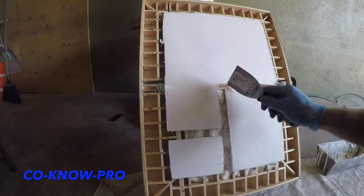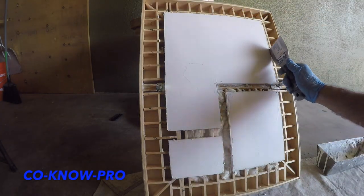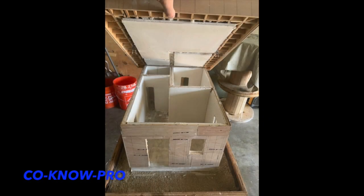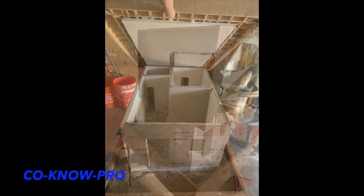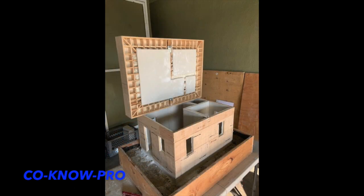I want to mention that the typical process on building a structure, before you do insulation and drywall, would be to seal off your roof first, then install your exterior lath — all your exterior paper and house wrap to waterproof the house. Then before you install your scratch or stucco, you install your insulation and drywall on the interior. Once that's done you go ahead and scratch and stucco the exterior. We've switched the process around a little bit, but as long as you're clear on that you'll be okay. Remember to subscribe and like if you enjoy this content — Kono Pro out.